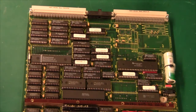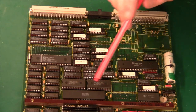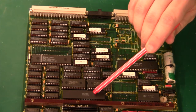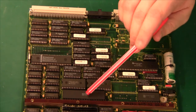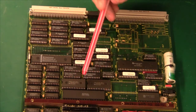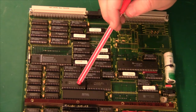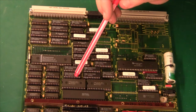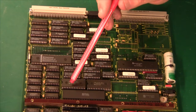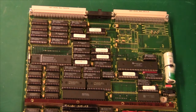Apart from additional RAM, we also have some static RAM — 16K of that. Next to it we have a hard disk controller chip. So it makes sense that data in and out to the hard disk would be buffered here in high-speed RAM. This static RAM is 150 nanoseconds, so it's not really that quick, but anyway this board has additional RAM and a hard disk controller.